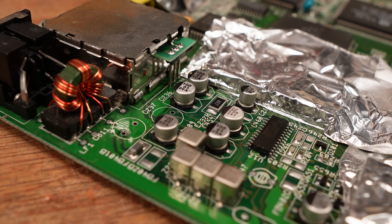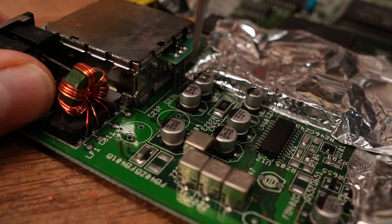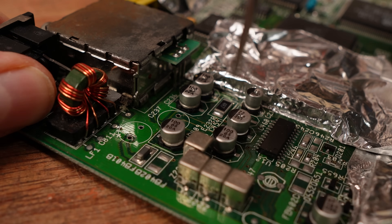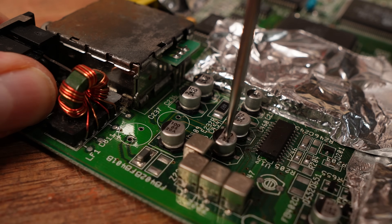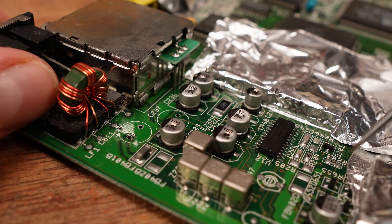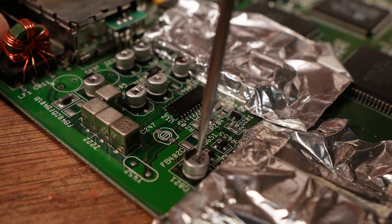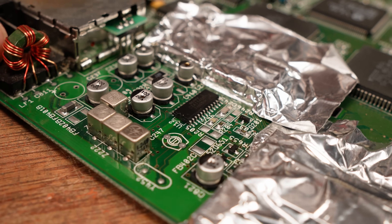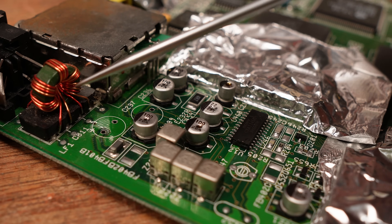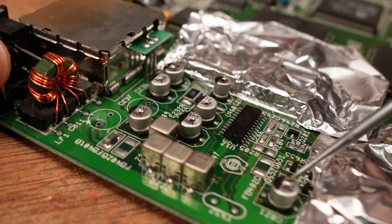Got a whole bunch of them here. These should all just come off at once so let's get them all pierced. My fear was there was going to be a load of electrolytic fluid all over the board when I did this, but that doesn't seem to be the case — it just boils away, and a lot of it just congeals on the actual capacitor. I'll start with these ones, work my way over to this side as the board gets hot, and end up down here.